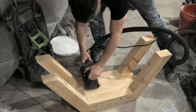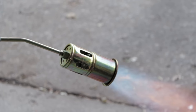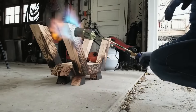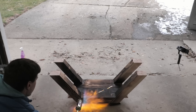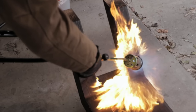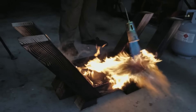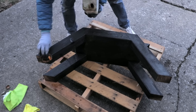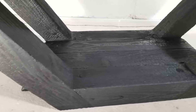After the glue dried, I used my belt sander to get everything level, and then took it over to my friend's house in the suburbs to play around with some fire and burn the base. I was a little nervous because I'd never tried this before, but it was actually just really easy — it's really hard to overdo. I was going for what's referred to as an alligator skin look where the charred wood remains and it's basically just blackened. You can also get a lot of different looks with combinations of browns by using a steel brush to brush it off afterwards. To get the alligator look, I used a Danish oil finish to soak into the wood and harden it up inside. I was really happy with how this came out.